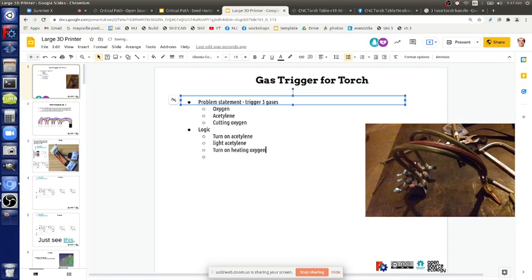In terms of safety, the cost of gas, ease of operation, maintenance, and maybe flexibility of applications, what is the difference between a plasma torch setup and a laser setup for this? I don't think anyone uses laser. You could do laser. Laser is like $50,000 for a laser head. So it's not cheap. This is $50, so 1,000x. As far as plasma, yes, you can do it. Comparable cost, but then consumables are more expensive, like the tips.